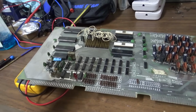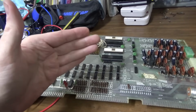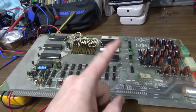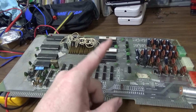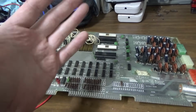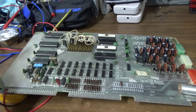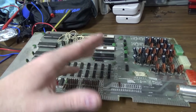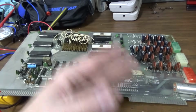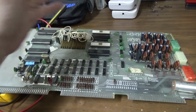Oh, and two more things. One, why didn't I do the test to make sure that the switch isn't stuck locking the coil on? We know that's not true because whenever I hit the right switch, it scored each time. So that switch isn't stuck on. And that's what makes the right thumper bumper work. And then two, I don't know if I mentioned it earlier. I started mentioning it, but I don't know if I got sidetracked or not. These boards are the same in every machine. They don't have different ROMs. So these chips are not different in each machine.